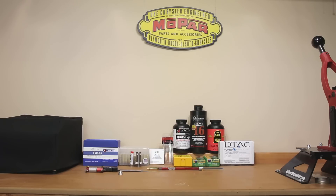The brass prep is typically so good on this that we're just going to make sure our necks are the right diameter, take a couple of measurements to make sure our headspacing is consistent, and once we've done that, we know our brass is good to use. If you don't have a headspace gauge, you could just put the brass in the rifle to ensure it chambers — in this particular case, I've done both. The one exception today is that since we've already fired 15 rounds of factory ammo, we're also going to decap and reload 15 pieces of Hornady brass as well, but that's kind of a side project.